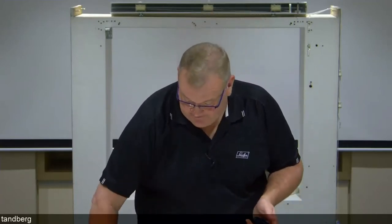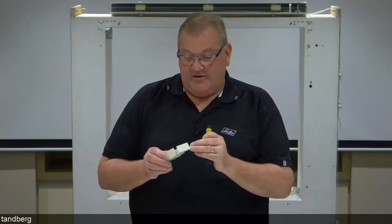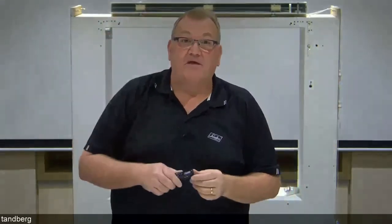Regarding deductions — this product is fitted with end mount brackets. If fitting in a reveal, your deduction is 10mm on the width and 10mm on the drop. Even on a face fit, if measuring from edge of architrave to edge of architrave, we still recommend taking 10mm off the width and 10mm off the drop. Both are important — without the width deduction, the head rail won't fit into the brackets.